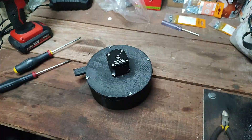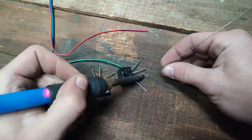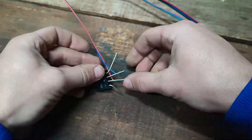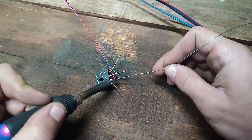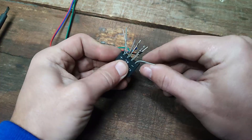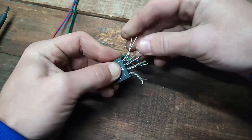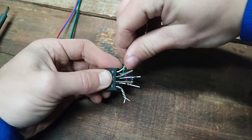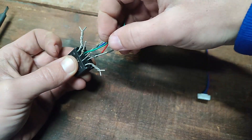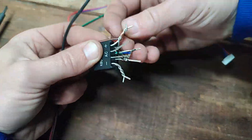Then there is the electrical part — basically two bridge rectifiers. They transform AC current to DC. I connect them in parallel so it increases the amp production and not the voltage. If you put them in series you increase the voltage, and that's not what I want because my electric circuit works from 8V to 35V.